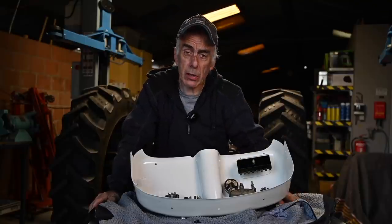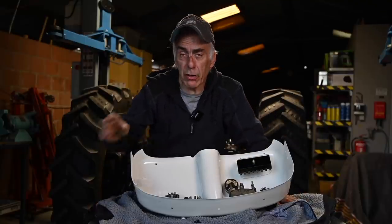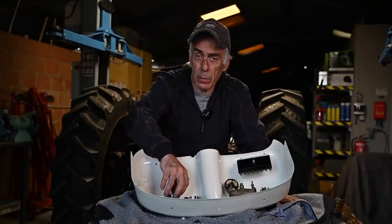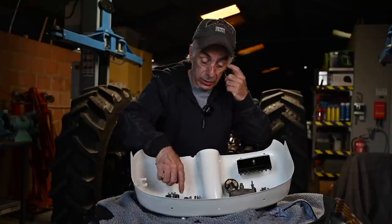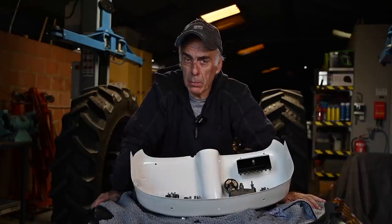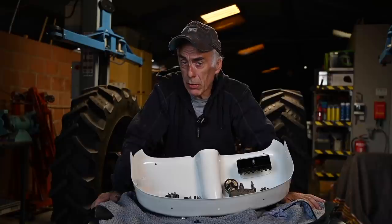That's the kind of work you have to do to identify how these switches operate. We've done the contact switch, but for the same reason I'll have to do the light switch and the blinker switch as well — there are a lot of contacts on those. It's not very hard, but you just need to go out and measure it and write it down, because that's not on your wiring diagram.